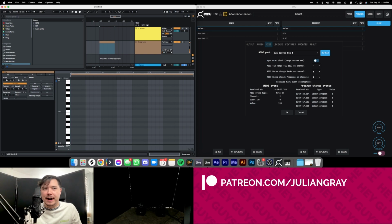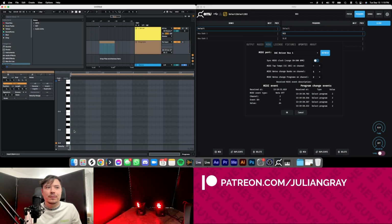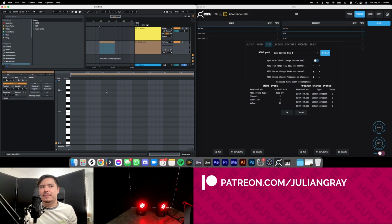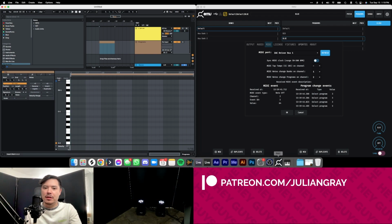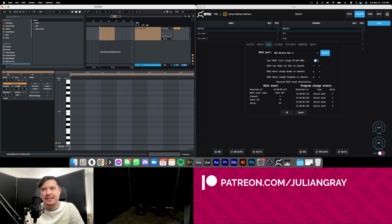It's because we're playing the bottom note. This is the first note of all of the musical notes in this MIDI channel. Send channel 2. As you can see, it grabs channel 2. And behind me, you can see the lights are now selected program 2. It's very self-explanatory from here. If we do 3, it'll grab the third program. This could be used to create whatever show that you want at a simple level.